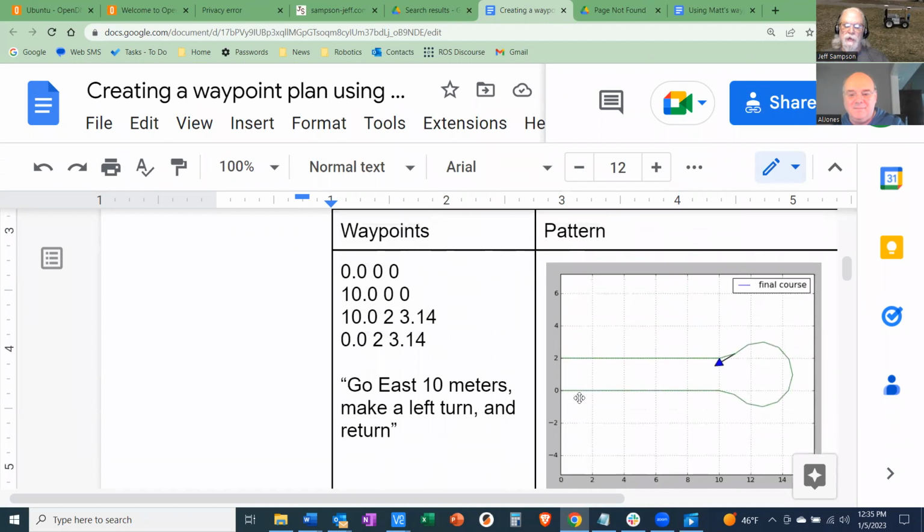So your simulated lawn tractor is doing exactly what it should be doing now? No, heavens no. Last time we spoke, I still hadn't resolved the speed. So once I get the speed resolved, then I'll try to give it one of these simple paths. Oh, I remember now. You kept changing the numbers, but it didn't seem to want to go any faster. Right. Thinking back, when I was going through the videos, when you first started, you said, oh, here it is driving, and it was driving at about 9/10 of a meter per second. As you went on throughout the meeting, it got slower and slower. I don't know why, but when you first started, it was going almost 1 meter per second. Yes, that's still a problem that needs to be solved.